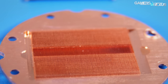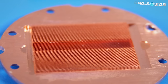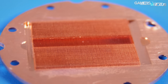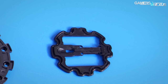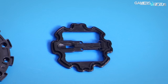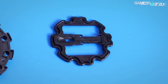It's up to manufacturers — folks like NZXT and their suppliers — to work together on a custom solution for the product, because a one-size-fits-all model, while deployable, doesn't mean it'll deliver the best performance out of the box. Some coolers, but not all, will use a rubber gasket for split-flow circulation. This sits between the housing and the cold plate and directs liquid down the center channel. Split-flow minimizes dead zones on cold plates, though straight-flow is an alternative that is also commonly used.